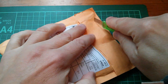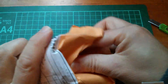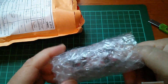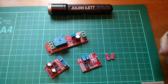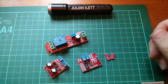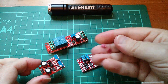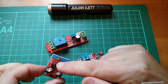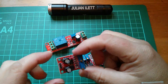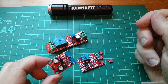This is the oldest one and it just says electronic parts. Not sure I can tell what that is, I'll have to unwrap it. So what this is, is a set of modules. These came from Alice, and this one is a 555 timer with some little links for selecting different capacitor values, a couple of pots, some smoothing caps, and it's for just creating a little 555 oscillator.